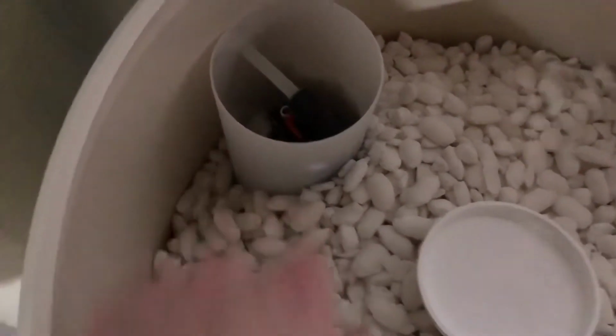Now the tube for your water softener is connected using what's called a sharkbite fitting. To remove the tube from the sharkbite fitting, you can remove that gray plastic piece you see on the left, and then once that's removed, you push in firmly and it should release when you pull back out.